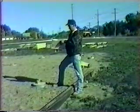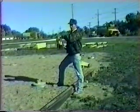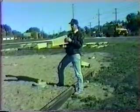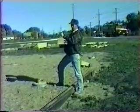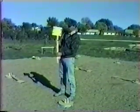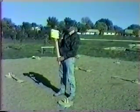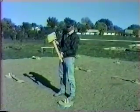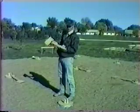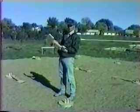Let's take a look at the individual pieces. This is an eave bracket. It fastens two outside wall panels to a divider panel at the top. It also holds the end of the roof rafter system. The aisle post connects two front panels at the top to the divider panel. It also holds the rafter system over the stall and over the aisle. This post changes with the different roof styles and different roof pitches.